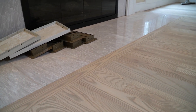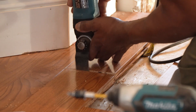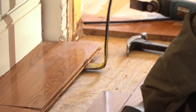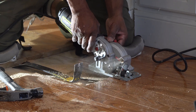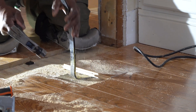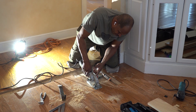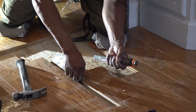Back there around the fireplace you really cleaned that up — you don't have that above-floor-level transition strip anymore, going flush into the marble. Looks beautiful. Everything gets glued in because a lot of times you're taking away the tongue and groove so it's not toothed together anymore, and you have to use a really strong adhesive. That is the key. There's a male and female of a tongue and groove floor and the male I can't use anymore because I can't tie into it with the square lumber I'm putting in. So I go down with a chisel and a saw, clean around each one, then glue in my new pieces — every board I put in gets glued all the way around. Your repairs are more solid than your actual floors.